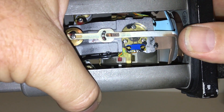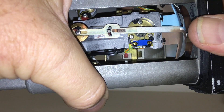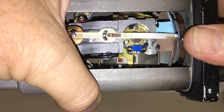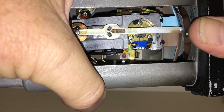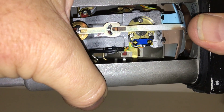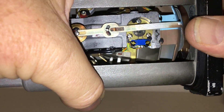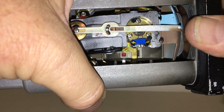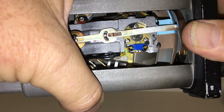This correcting action occurs any time a misalignment occurs — it doesn't care whether that misalignment is produced by normal precession of the gyro, by extreme maneuvers such as flying aerobatics, or simply by flying around the curvature of the earth. The unit doesn't know what is causing the misalignment; it simply responds to any misalignment immediately by correcting it back to level. I have seen some comments on my previous videos saying that these pendulous vanes are not designed to correct for the curvature of the earth, but that's a false statement. They're designed to do one thing: keep the gyro level. They don't discriminate — they will correct regardless of what has produced the misalignment.